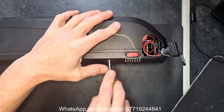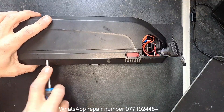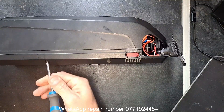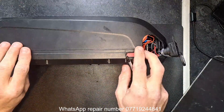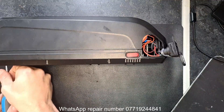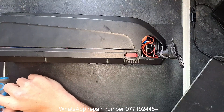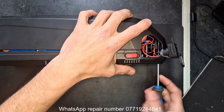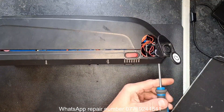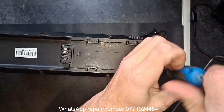As I said, it's already been opened. It's 36 volts, which is kind of strange for one of these — usually they're 48 volt, coming in 13 amp hour or 18.4 amp hour flavours. The blue wrap is still intact around the cells, so I imagine they haven't been checked for balance. My first inclination is it's just the BMS. We need to check the cells first to confirm there's power in them, but from the symptoms — the discharge voltage combined with the charge port voltage — I'm guessing the BMS mosfets have blown.